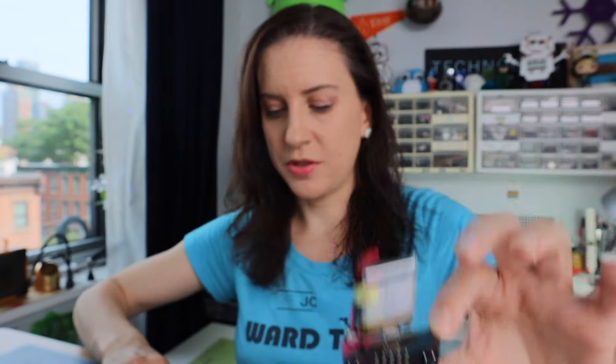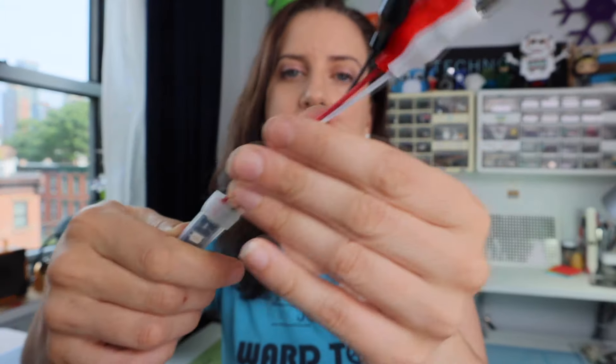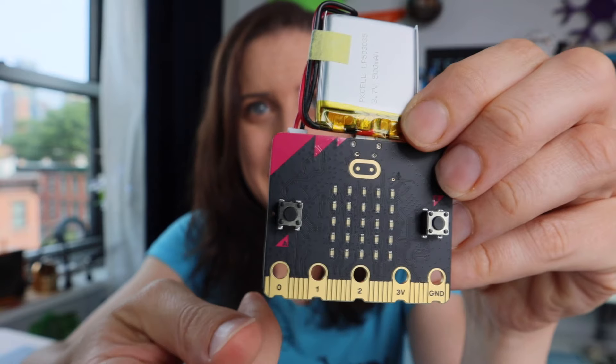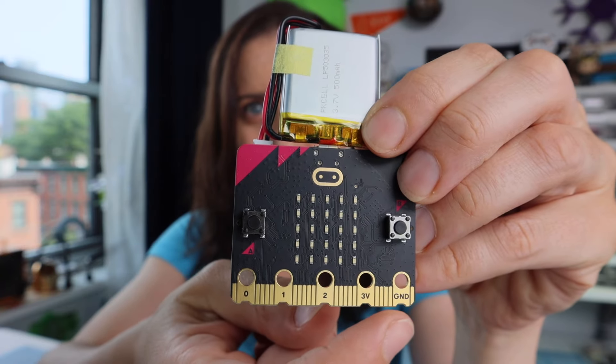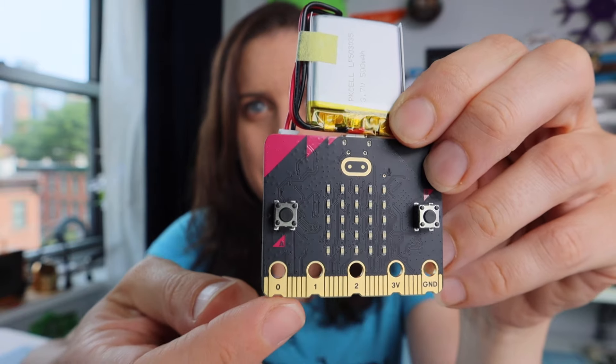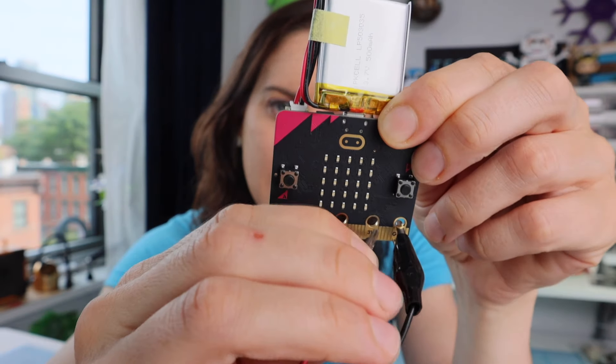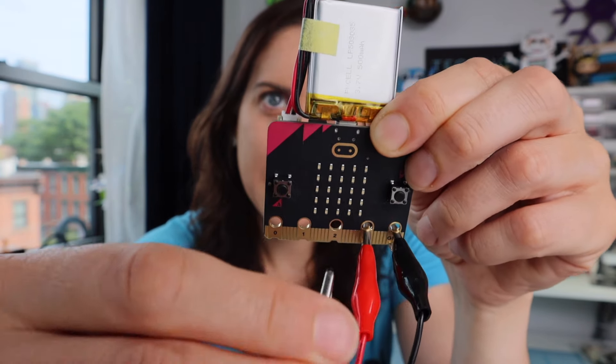When we have our NeoPixel strip, we have three wires coming out of it. The red wire is power, the black wire is ground, and then a third wire — in this case white, but sometimes they're all different colors — is the signal wire, the one that data gets transferred over. We want to connect power to 3V, ground to GND, and then pick a pin to communicate our data over. I always like to use pin 2 because it's right next to ground and 3 volts, though it's also very common to use pin 0. We'll connect ground, power, and our data pin using pin 2.